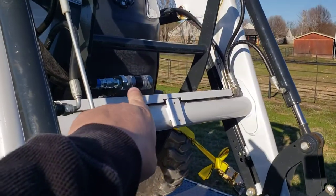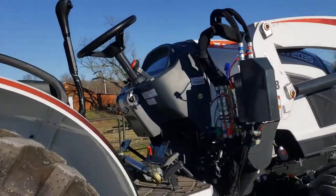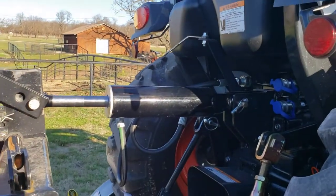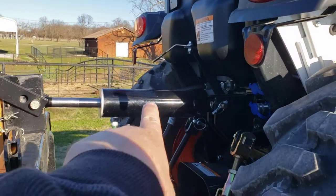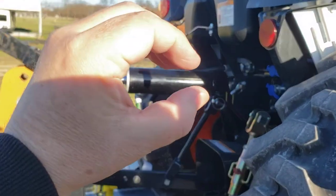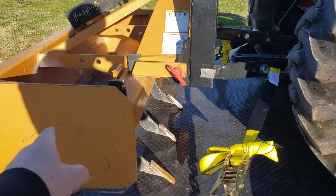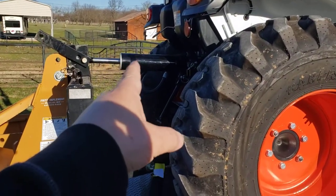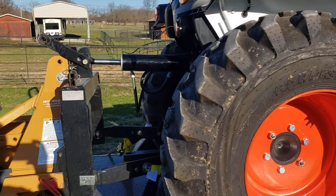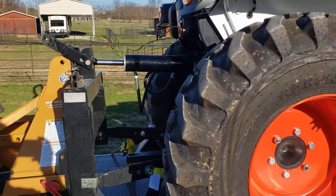The reason I'm hauling it now is I had front remotes added — I'll make a video on that later. I also added four rear remotes and a hydraulic top link. For this size tractor, this hydraulic cylinder is literally double the diameter of the ones they recommend, but if you're doing plowing or dragging heavy rock it makes sense. The standard ones are $200–$235 everywhere online; this one was $400 and is supposed to be heavy duty.